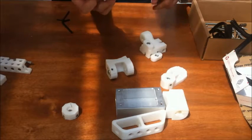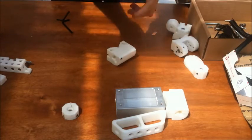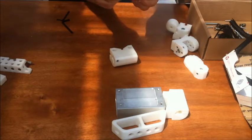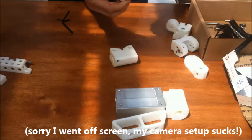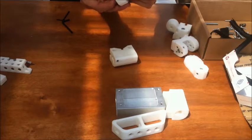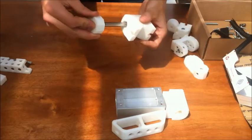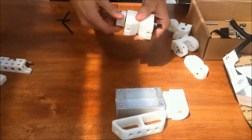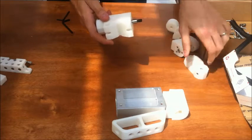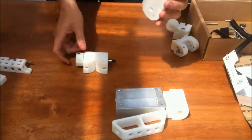I'm going to go back to this piece and assemble the rear assembly now. The shoulder screw goes into the spring tension bushing, then you put the spring on. There's no way to put it on backwards — it works both ways. And then that slips into this part. The shoulder screw should be nice and loose, like that. Oh — one last thing: this piece needs to have the quarter-inch spring pin pressed in.